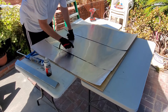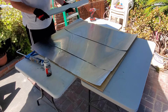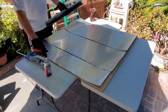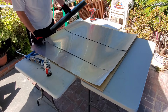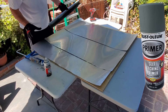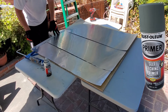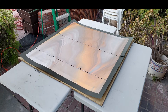Since the roof edging is galvanized and the flashing is aluminum, we needed to protect against galvanic corrosion. We spray-painted self-etching primer on the roof edging area, put a two-inch stripe of primer down each edge of the board, and then applied silicone on top. We used stainless steel screws to secure everything once it was placed down.